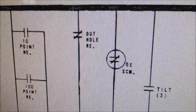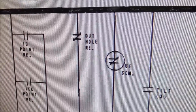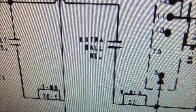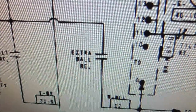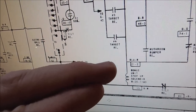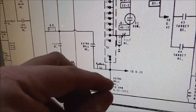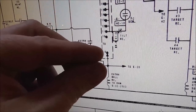for whatever reason, these never open up at the same time. So I'm going to go look at both of those switches and just see if one of them's like a little too close or whatever. I'm also going to make this one a little wider so that it is a little farther apart. Sometimes if they're too close together, whenever it opens all the way up, if they're still really close, what that means is that when the power is killed to it, the coil lets go and this switch starts opening up, but it's so tight that it doesn't open till just the end.